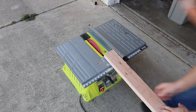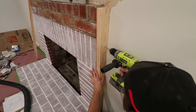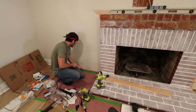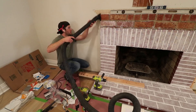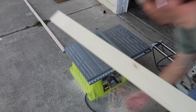The first step was to install support studs on either side of the mantel. A normal stud measures three and a half inches wide, but the fireplace only stuck out about three inches, so I ripped the boards down to size. I pulled up some of the paper and tape on the ground so the stud could sit directly on the floor. I first used a normal wood bit to drill a few holes in the stud — when I punched all the way through, it left a mark on the brick. I then used a masonry drill bit to continue the holes in the brick, making sure I drove straight in and not at an angle. I put these holes in the middle of the bricks, not too close to the edge or too close to the mortar, or else I risked cracking the brick. When that was all ready, I used masonry screws to connect the wood to the brick. I did the same process on both sides of the fireplace, keeping the vacuum handy to clean up the dust.